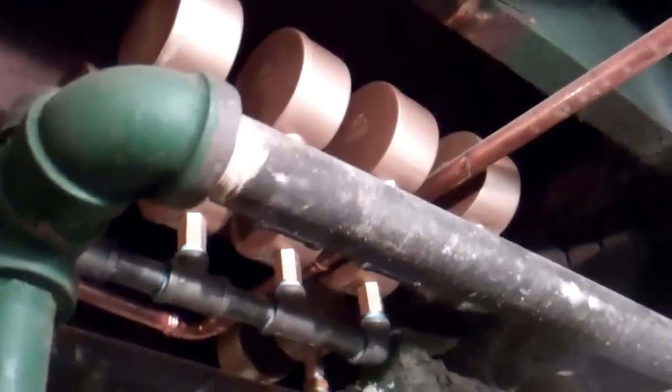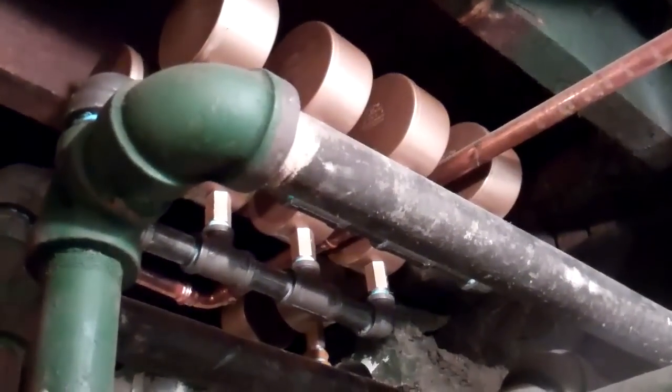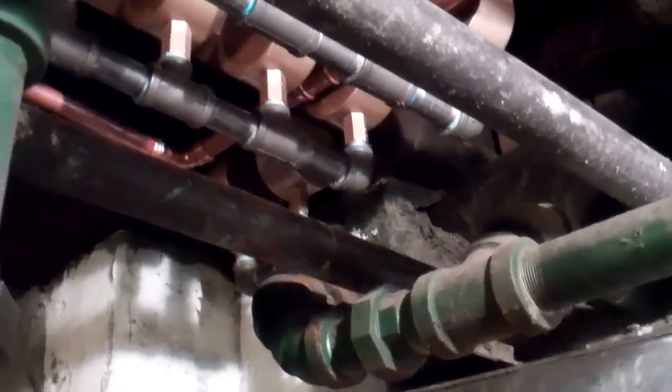And that's how the system breathes. We can get the steam through the mains expeditiously with all the main vents on the steam mains — four on each side. And then once steam is through all the mains, the radiators themselves can breathe through the remaining two vents on the return line.